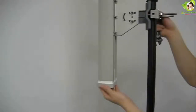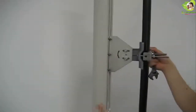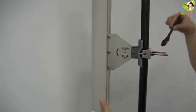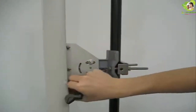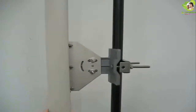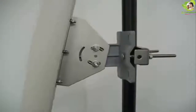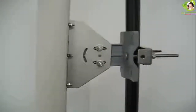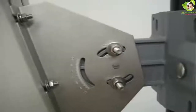In the following section we will show you how to fix the antenna onto the pole. First you have to adjust the height of the antenna on the pole from the ground level. Then adjust the mounting position on the antenna by loosening these screws and moving it up or down. Adjust the antenna tilt angle according to your required site coverage — it can be tilted up or down. As you can see on the grading scale, you can adjust it to a maximum of 30 degrees upward or downward.